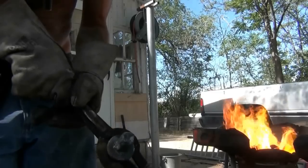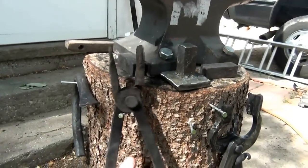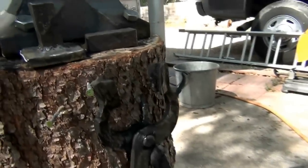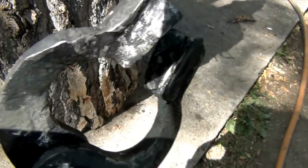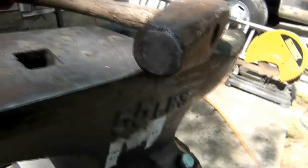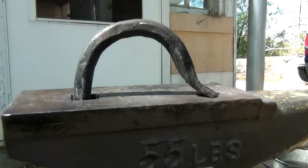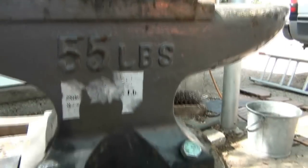There you have it — custom fit. A couple of things I've rocked out since I built the forge: got a pair of tongs — they just come as blanks, pretty easy for the beginner. Got your ugly bolt tongs — lots of work to do on them. I had a couple of hooks to hold my hardware, and got your hold-down bar. You just drop that in over your work, and when you thump on that, see how it sticks? It holds your work down so you can chisel on it. Hit it on the side to get it out — rock and roll.